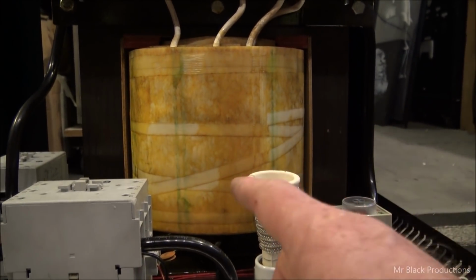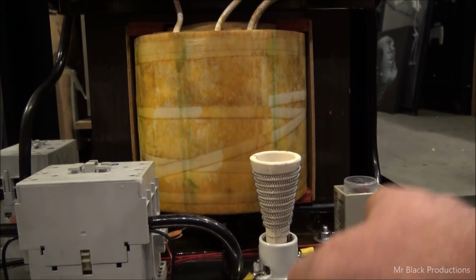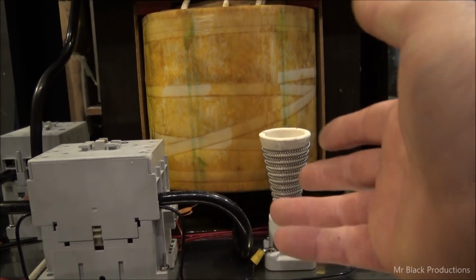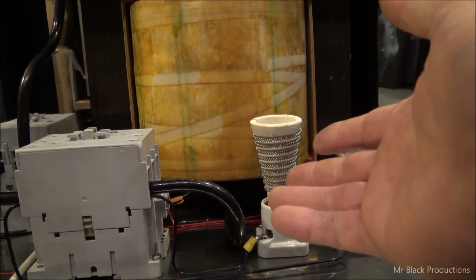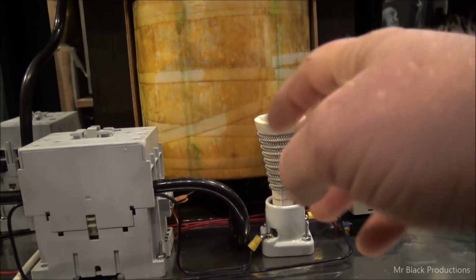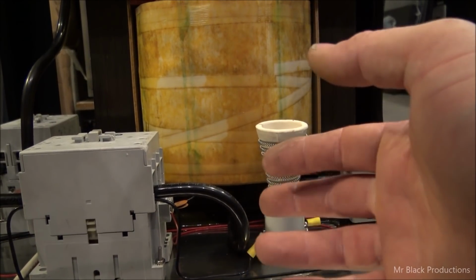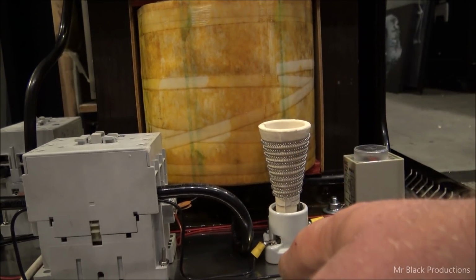Okay? And the whole point behind this is to control the electron flow into this mammoth of a transformer. Now, your SB220, your Kenwood 922As, even that Ten-Tec Centurion, and even some of the Ameritron amplifiers use voltage doubling circuits. So they'll take, to make the math simple, a 1,000-volt transformer, and use a capacitor bank to double the voltage into about 2,400 volts, but you lose half your amperage ability.